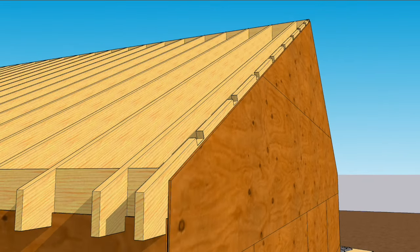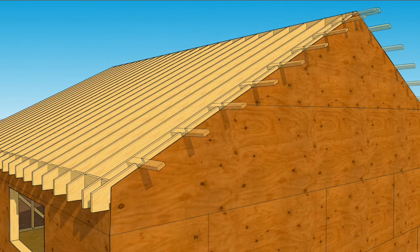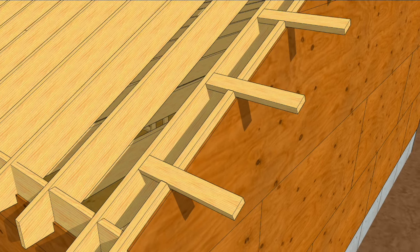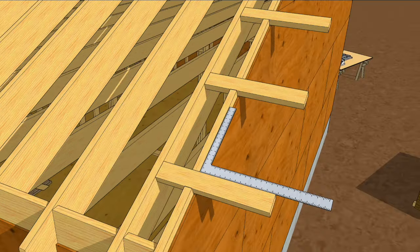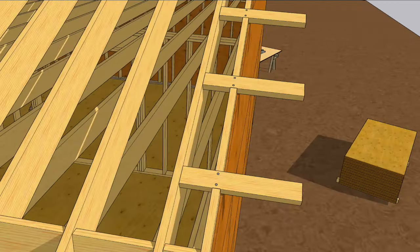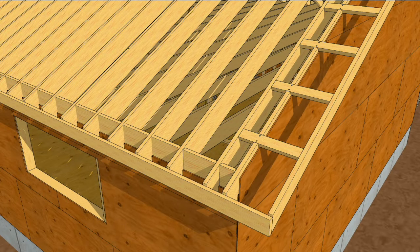The three-and-a-half by one-and-a-half inch notch should be spaced every two feet and placed to land where the sheets will break. Two-by-four outlooks should extend back to the second rafter and past the first one by whatever the overhang is, minus the thickness of the sub-facia. Make sure to square up the outlooks before nailing them through the inner rafter. Then nail through the face of the outlook into the notch of the outer rafter, and you're ready for sub-facia.